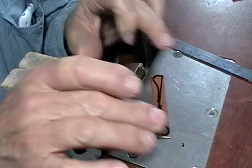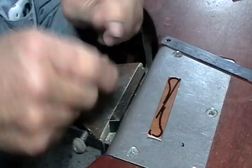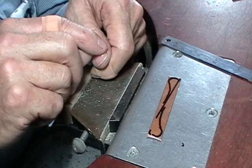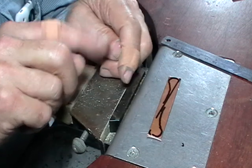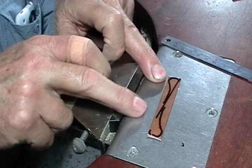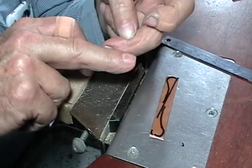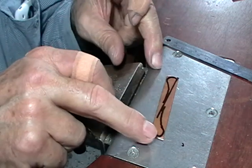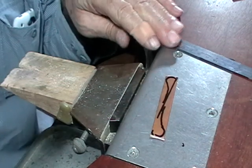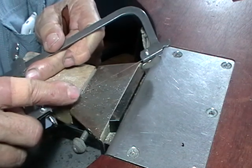You can draw this full size on a piece of paper, and oftentimes it would be handy to do that because you can just fold the paper around the ring mandrel at the proper size and have a look at it to see if that's what you want. If it isn't, modify it accordingly. But because I know what I want, I'm just drawing it straight on the metal and I'll cut it out. We want two sides flat where they're going to lay next to each other on the finger, and the other two sides slightly rounded — those are what we're going to form anti-clastic. Cut it out and sand it back.